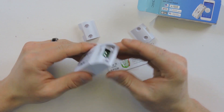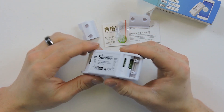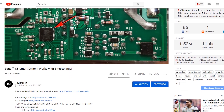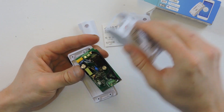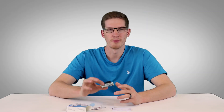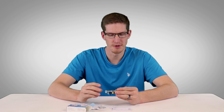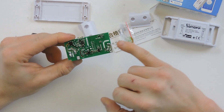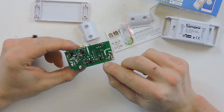It's maybe bulkier than your standard smart switch, but keep in mind this uses Wi-Fi. I made a video on this over a year ago and they've been honestly one of the more reliable switches that I have. If we crack into this we can see the board itself. The new design has two black wires on top, whereas the older one had just a bead of solder across the bottom with an air gap.